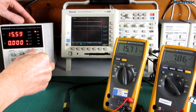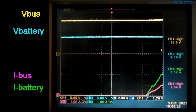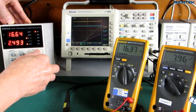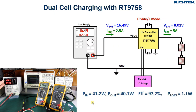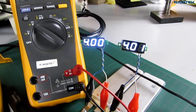When I slowly increase the input voltage more, you can see that the battery current and input current rise together, but now the battery current is 2 times the input current. When the input current reaches 2.5A, the lab supply operates in constant current mode and both input current and battery current stay stable. The battery charging current is now 5A again. The input power is around 41.2W, the output power is around 40.1W, which means the efficiency is now 97.2%, and the power loss is only 1.1W. So the divide-by-2 mode is more efficient than the bypass mode. The two battery voltages are quite close, so the batteries are well balanced.